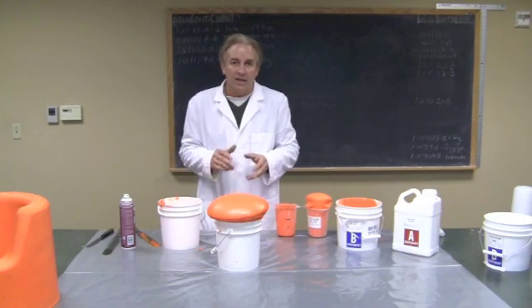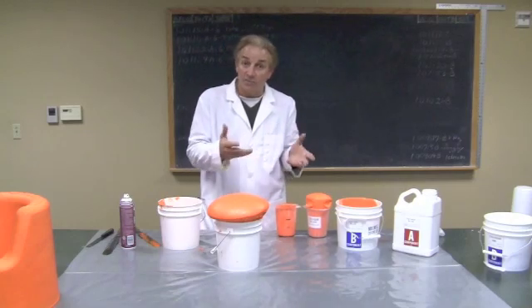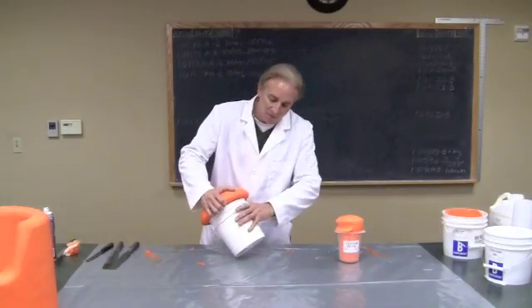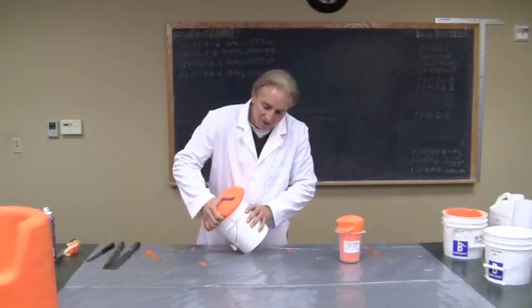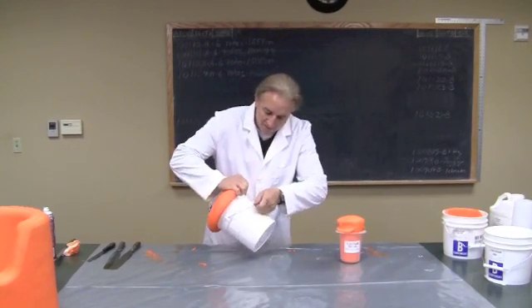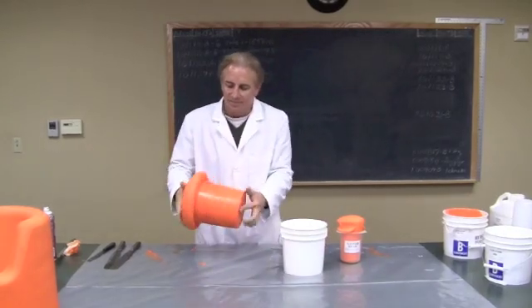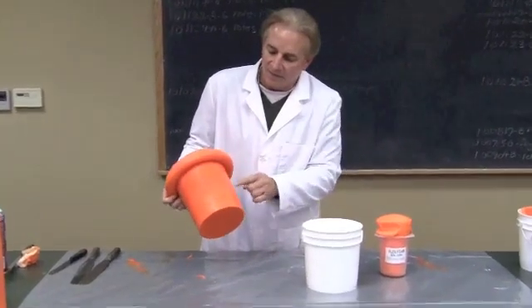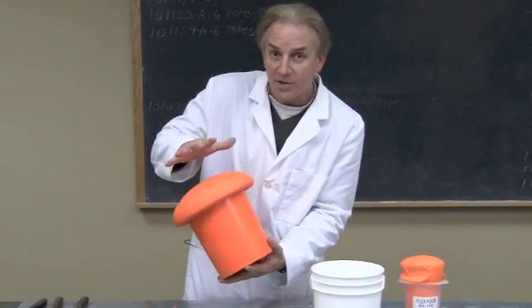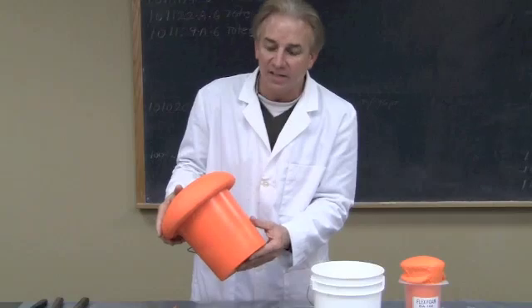The neat thing about it is it contours, molds around it, and allows you to take shapes and make flexible objects that can be used for production items. So we're going to take it out of the mold. We've put a little release in there. We're going to work it around the edges and then start tugging on it. And there it is — there's the part. You can see the skin is compressed in some areas, in other areas it's not. But if we had back-pressured the mold on the way back up, you get a perfect skin every time.